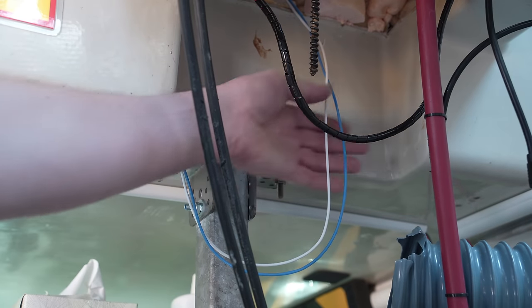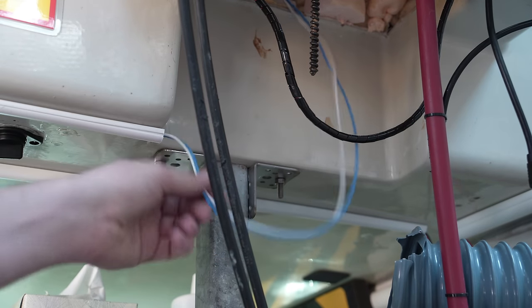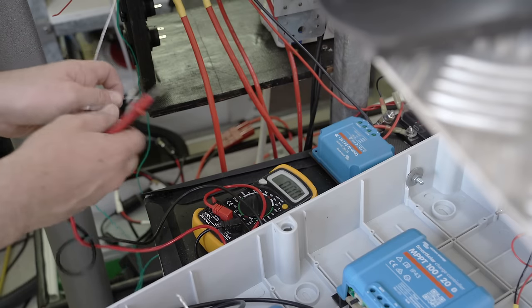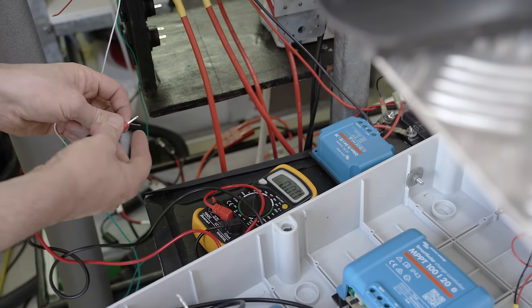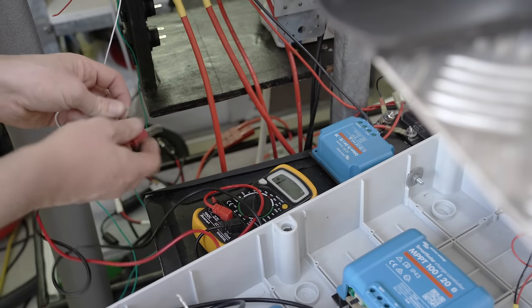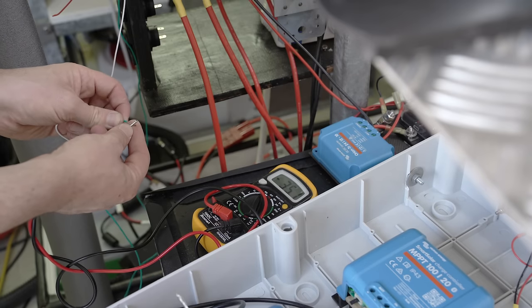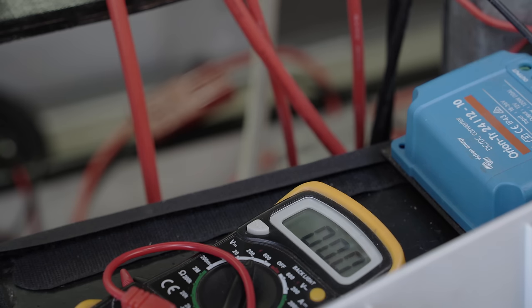As I said, I'm not going through all the mounting and cable routing here, as I'd like to still have a few subscribers left at the end of this — but you'll have to take my word for it that electricity can flow from the solar panels, through the deck box, and down inside Allen. Before wiring anything up, I thought it best to check the open circuit voltage for the two panels. 35 volts in dim shade isn't bad, so green light for the next step.